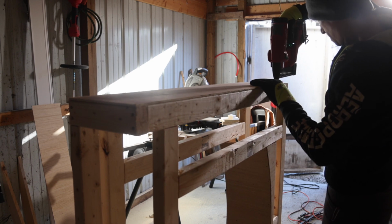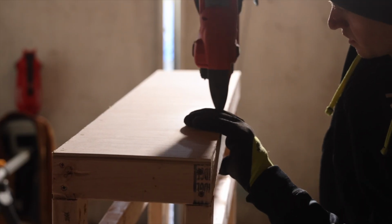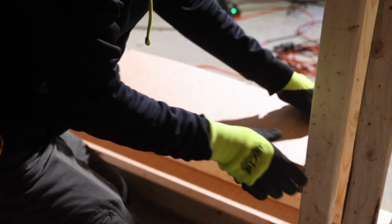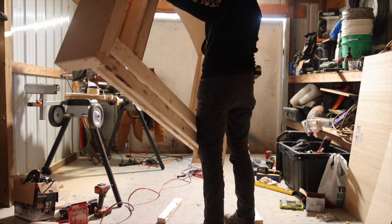After that, it was time to go on and finish the other pieces. I put all the sides on and the top and bottom of the inset before doing the front facing piece so that the front facing piece of plywood would overlap all those exposed sides of plywood.